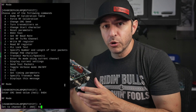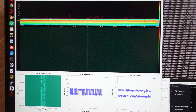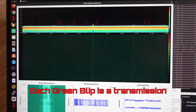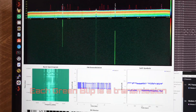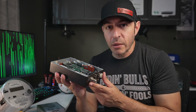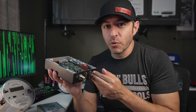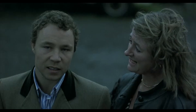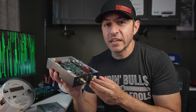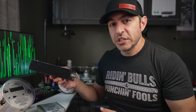But I wasn't able to actually talk to it in its native operating mode, where packets are coming into the port and it's translating that, hopping around on the frequency side, and sending that data out to the meters. The meters hop around on different channels within the 900 megahertz band. These modems also hop around and send data to those meters — so the computer side just sends raw data into the network and the modem figures out how to hop around and communicate with the meter.